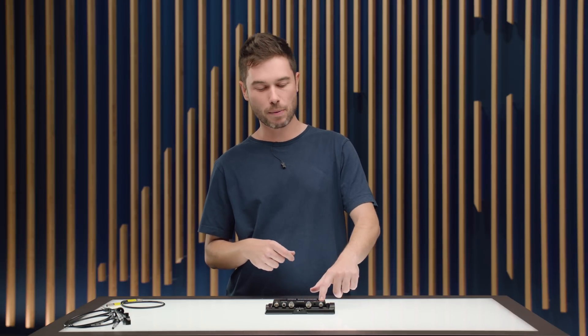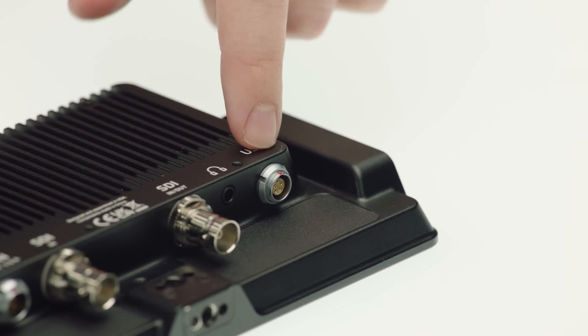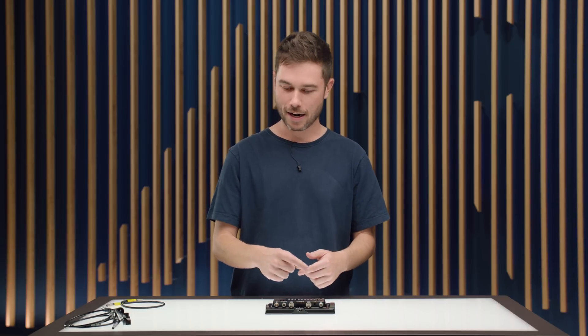The headphone connector gives you access to all of the normal routing options for your audio signals in the camera menu. Next to it we have a new connector — USB on a 5-pin LEMO connector — and there will be a USB to Ethernet adapter available for situations where you'd want to use the CCM1 on an Alexa Mini LF while also having an MVF2 viewfinder connected, since there's only one viewfinder connector on that camera. In that case you could use USB with Ethernet and power and SDI in to give you access to some camera control functionality, mainly the status components overlay with interactivity.